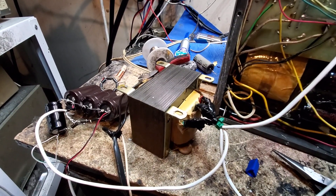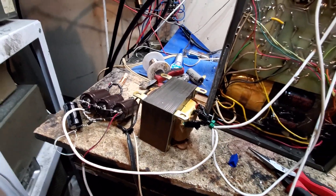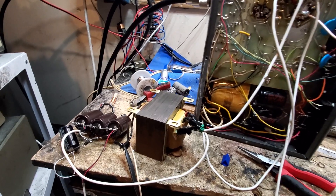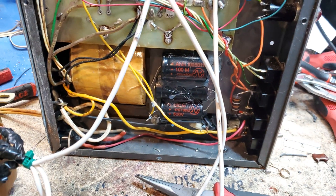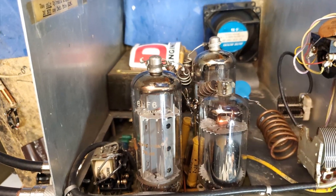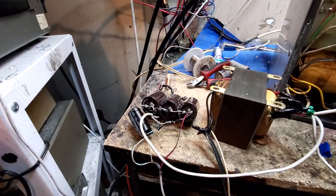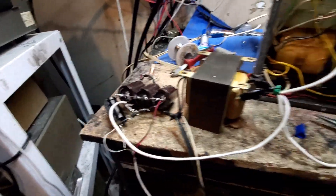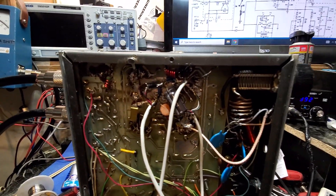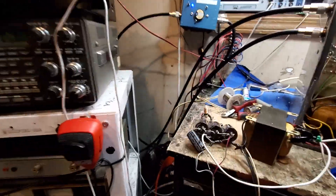Mixing 6LQs and 6LFs — those two really don't get along, or this amp had more problems than I thought. We ended up going through the whole thing. All new caps in the original amplifier section, new caps for the driver tube section. This one is a full-wave bridge off the original transformer; this one's a doubler off a little transformer we had in the corner. What's coming out is about 300-400 volts high voltage AC, 6.3V filament, and 12-something volts extra winding. We put the filaments straight to the six volts on the tube, doubled the high voltage through a doubler — we've actually got about 850 volts on top of that single 6LQ6.